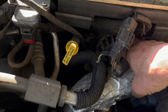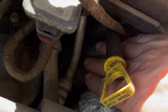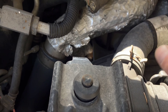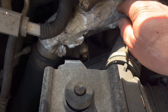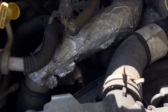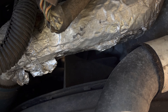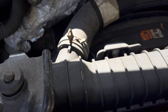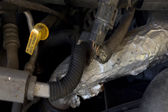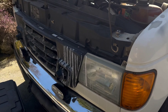This is a dual alternator setup — one is packed right in there and the other one is right down there, deep down there. So I have to do a little bit of undressing here: take out the intake pipes for the turbo, maybe move the coolant hose, take out the shroud to give me a little bit of room so I can bring the shroud backwards close to the radiator and start working.